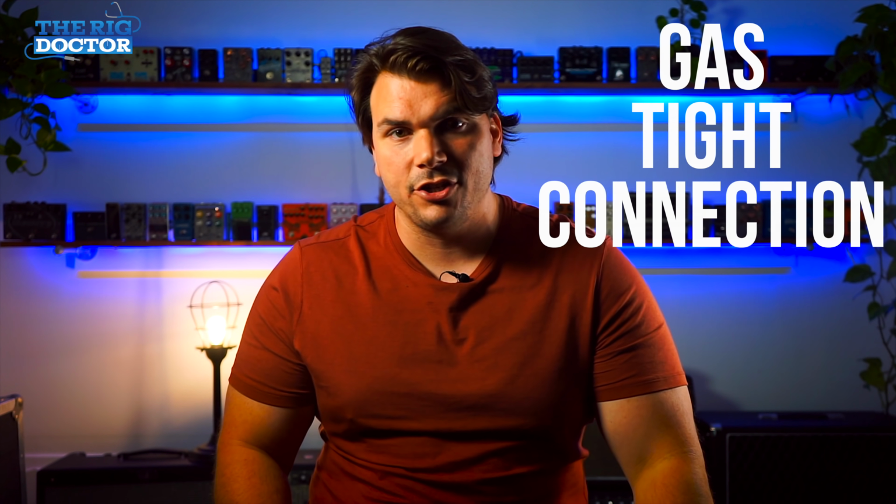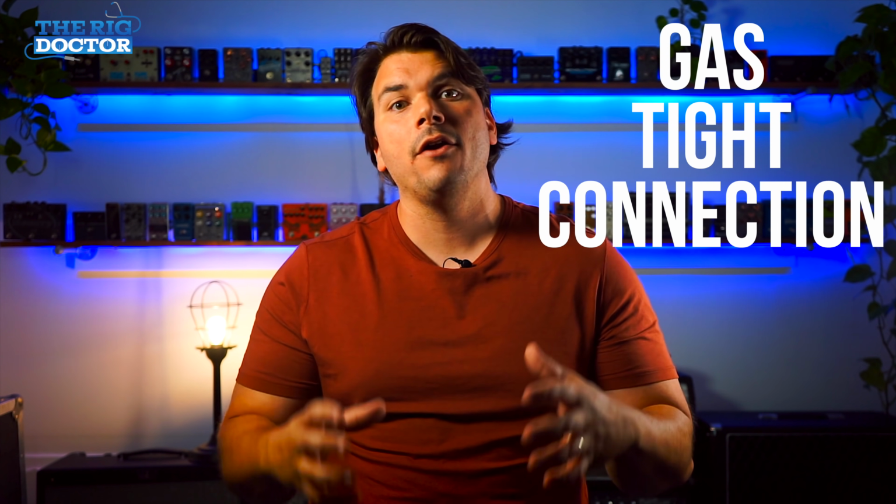Now, soldered cables, however, differ in one major way, and it's a way that I've talked about over and over again, so I apologize to those of you who have already heard me say this, but the most critical part that differentiates soldered versus solderless is that a soldered cable is a gas-tight connection. That means that where the shield is connected and where the center conductor are connected, they risk little to no exposure to the elements.